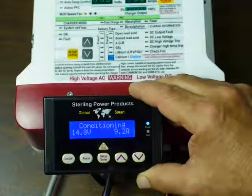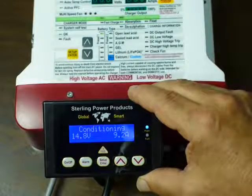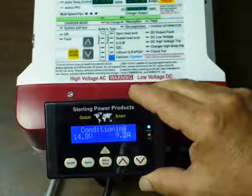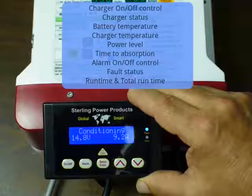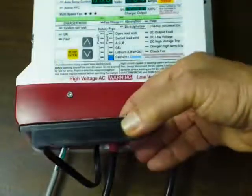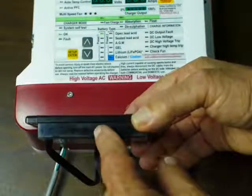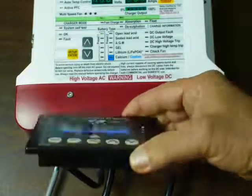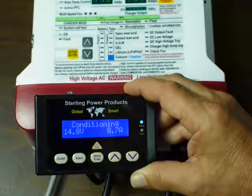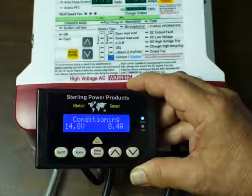I have the remote hooked up here. It comes with 30 feet of cable with phone-type plugs, so it goes through a small hole pretty well. Except for putting the charger into standby, it's all about the readout — it shows the voltage, the amperage, the battery temp, the charger temp, the time remaining on absorption, the percent power output, and so forth. It can be recessed into your panel or surface-mounted — there's a skirt that goes on so it can be mounted to any flat surface without cutting into it. It's nice to have, especially if you don't have any other charge or battery monitor in your system.